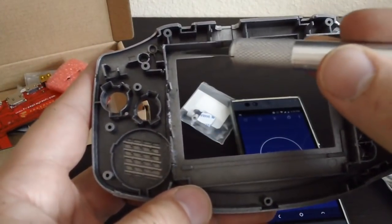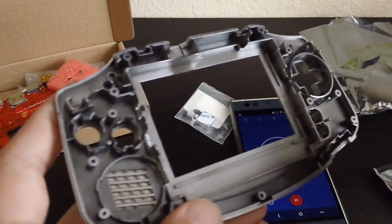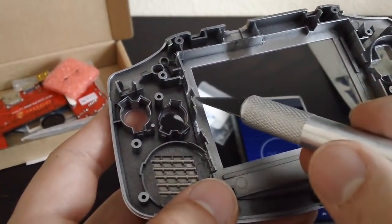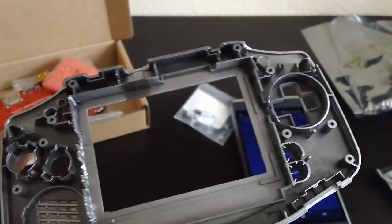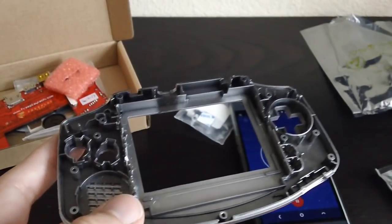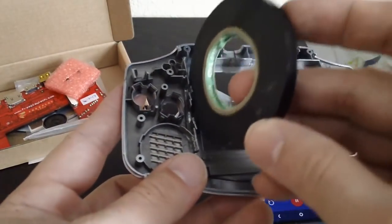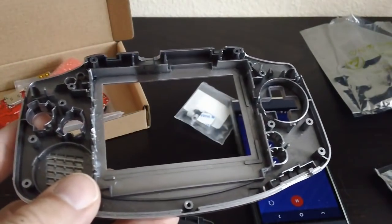You could see from the case that on some corners it has this little raised area — that's not good because when you put the LCD screen on there, if it's uneven and there's pressure against it with the Raspberry Pi thing, that could crack your LCD. So it's recommended that you put something on this side to pad it out or get rid of these. Since I already have a Dremel, I'm just going to shave those off. Alternatively, you could use a few layers of thin electrical tape to even it out — just something to keep in mind to keep this build a little bit simpler.